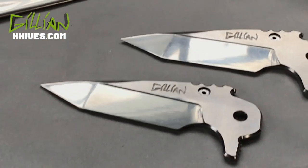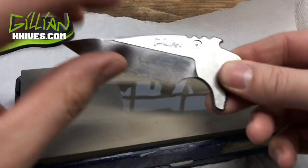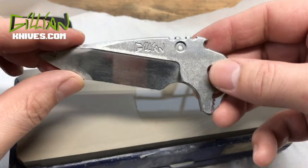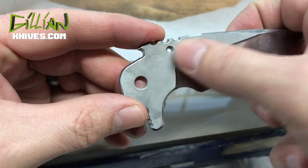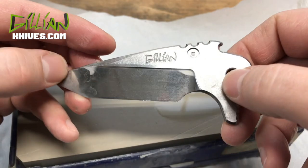Following the plate quench, we're going to use liquid nitrogen. What I'm getting ready to do now is lap the cheek of this knife to make sure it's truly flat. This blade has been surface ground and engraved, and now I'm going to lap it. You can see on the back side I've already lapped it, so now I'm getting ready to lap the cheek on this side.